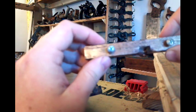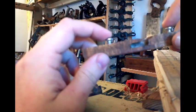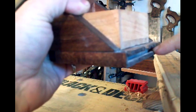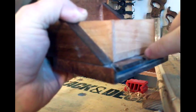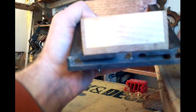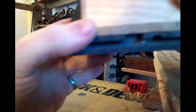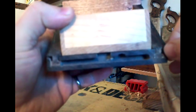I marked my spots, used a drill to drill a little pilot hole so the wood wouldn't split, and then put the screws in. You can see the other side of it here — this is the slotted key that the front piece slides in. It's basically a T-section. You can see where I've removed some of the wood — that's where the pan head goes into from the top — and you can see part of that pan section is revealed. Looking at it head-on, I've done the inverse of that section on the bottom piece.